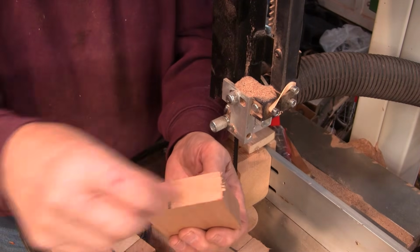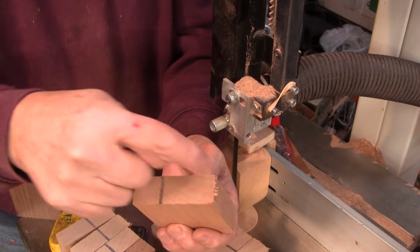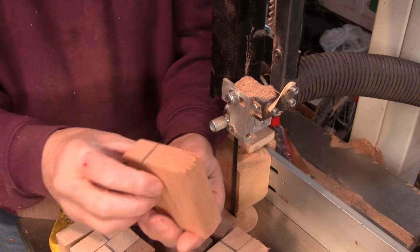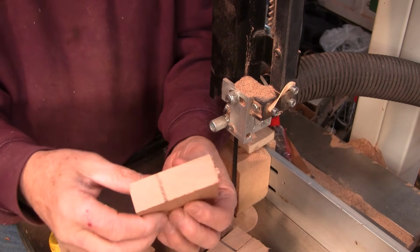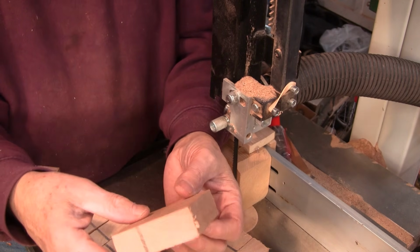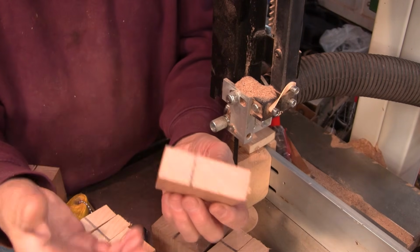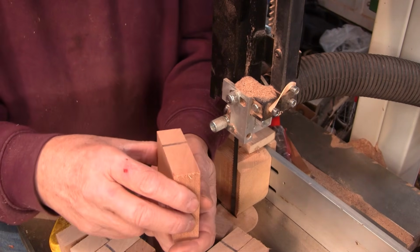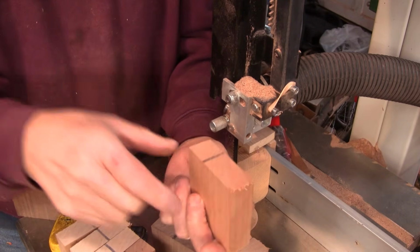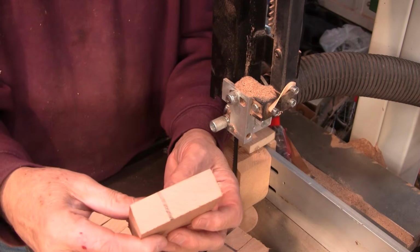Alright, it's time to cut these pieces into angles. I'll be cutting 12 degrees, basically from corner to corner. That'll give me 2 pieces. And I need a total of 30. Half will be walnut, half will be cherry. And 30 pieces times the 12 degrees makes a 360-degree circle. That's why I need 30. I also want them to be end grain going up when I cut. So I put a mark on here so I don't get them confused because they are basically square.